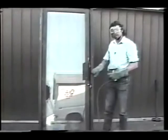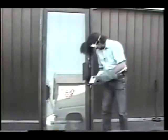This is an aluminum frame door. Sturdy. We've got our rabbit tool now. We don't have a jam to put it against, so we cannot open it the traditional way. What we're going to do is use the tool as if it's a jam spreader. We're going to put it in here and see if we can force the jam apart and pop the two deadbolts here. Let's see what happens. Does force it. Very easily. Takes it right out of the frame.